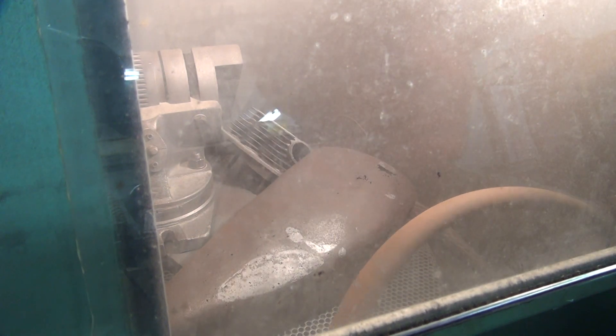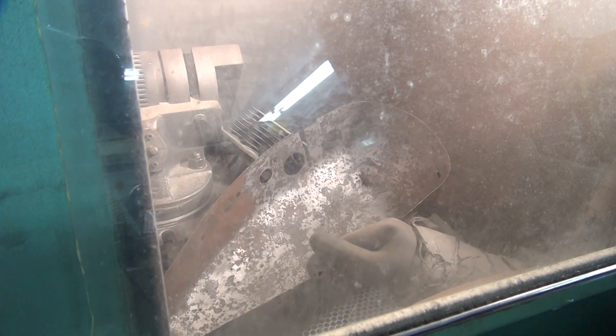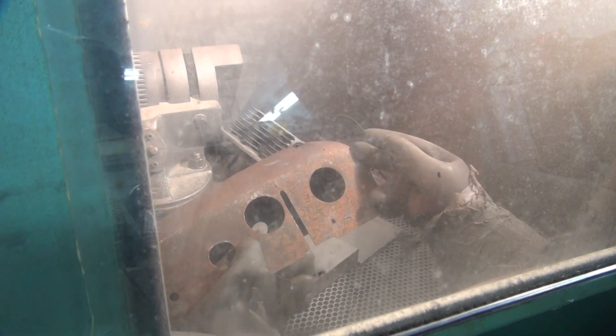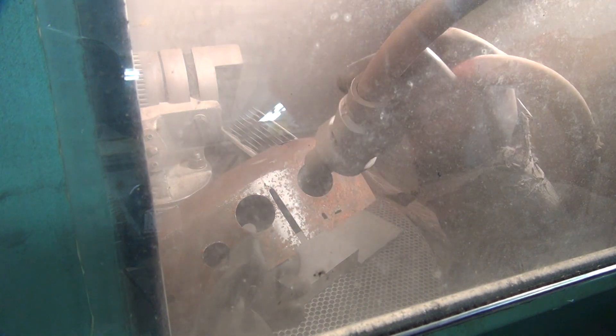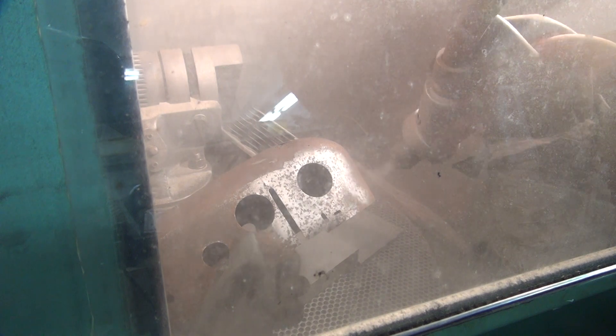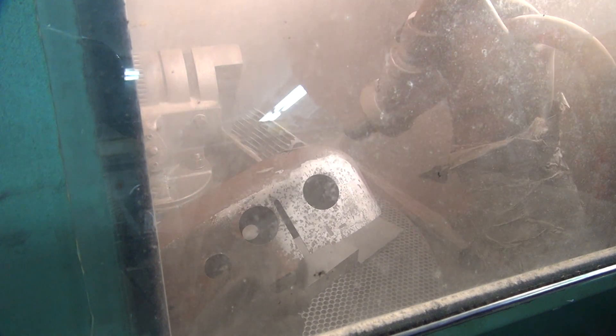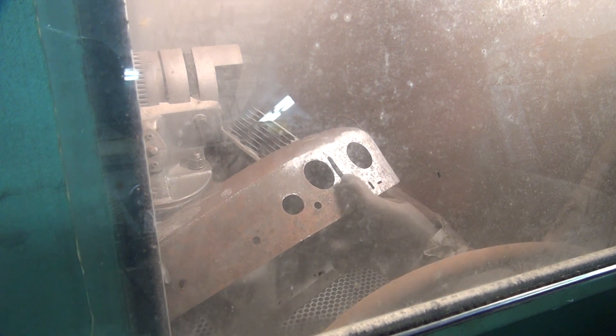This is where the lead is right through here — it protects the metal. Usually that means it's a dent right here, but in this case it looks like it's more of a bondo-type build up. It's too rusty. I think we've got a rip going through here — that's not good. This is all leaded together so the lead protected the surface. It's not too bad, so this might be halfway decent.